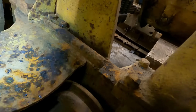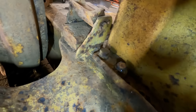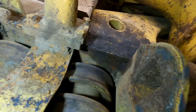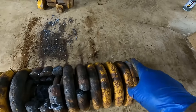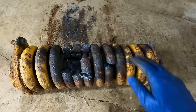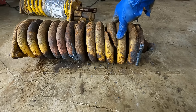Last thing to deal with is getting these guides out on each side. The bolts are all just rounded off — whoever took them off last time did not replace them with proper bolts. I cut the ears off and got it out without wasting too much time. I would have wanted to cut the inner spring anyway to remove all tension before hitting or heating anything. Now I can find where it actually broke — and there it is, that coil just completely tore. Amazing.